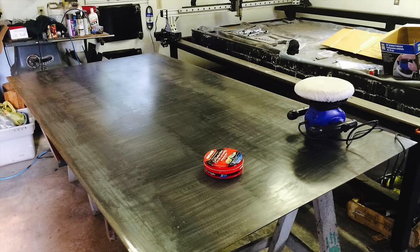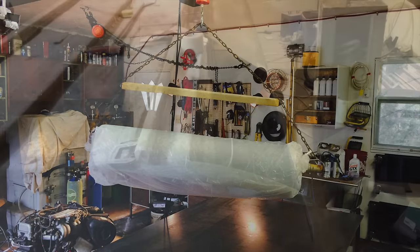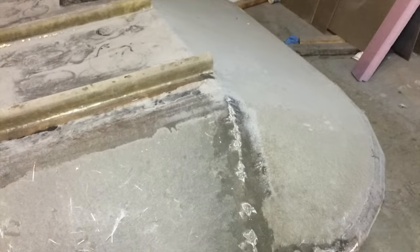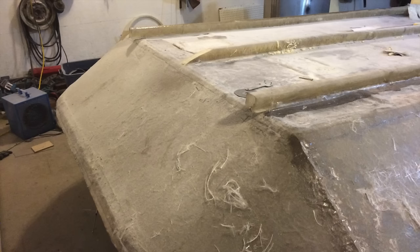I needed flexible fiberglass panels to complete the hull, so I made my own sheets by waxing a steel plate and then laying fiberglass matting onto the steel sheet. The wax made it easy to peel away from the steel sheet. I had to close in the plenum where the air would get directed through holes that would feed each skirt segment. You will see the fiberglass runners I fabricated for the bottom of the craft by waxing a 2x2 board and covering it with fiberglass. With the bottom sheets in place, I was able to fiberglass over the structure to provide rigidity.